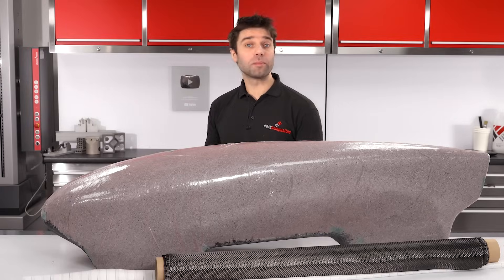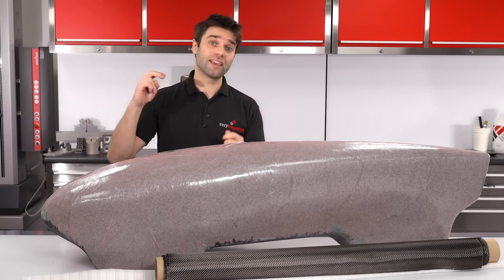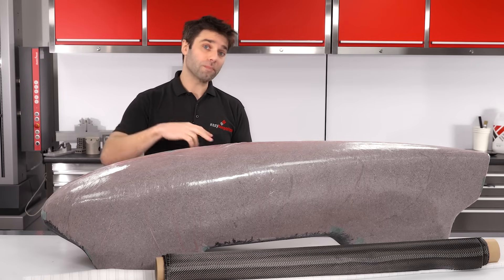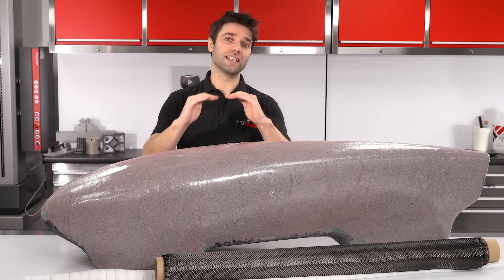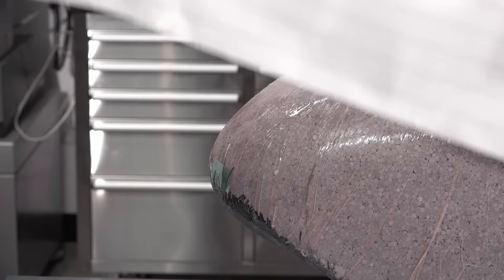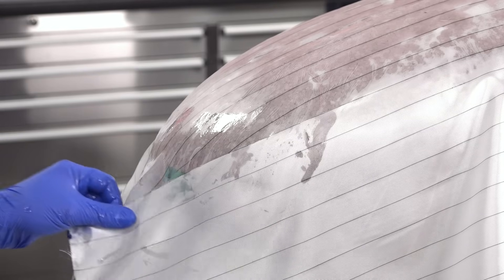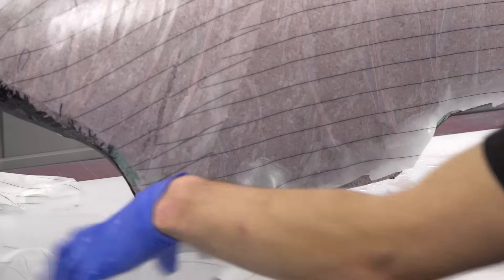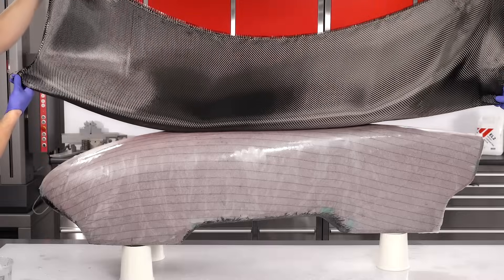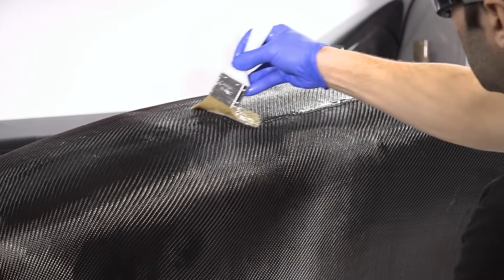Now ready to continue on with the second layup, I'll be doing this in much the same way as I did the layup on the underside. The main difference is that I'm using slightly oversized pieces of material, then I'm going to wet them out and tailor them in on the job. This gives me a bit more margin for error on the initial placement, and also when you cut the fabric when it's wetted out, it doesn't fray as easily as it would when it's dry. The peel ply should stop short of and not overlap the reinforcement on the underside to ensure the two sides bond properly.